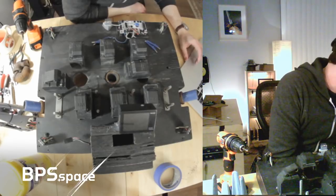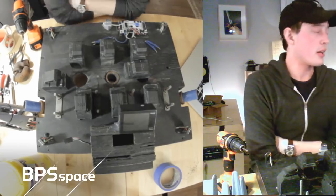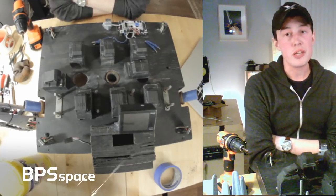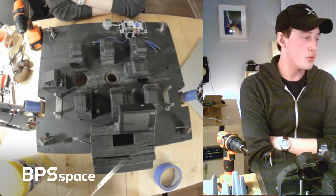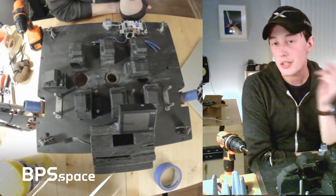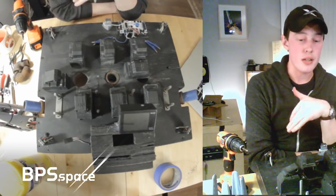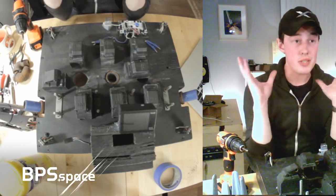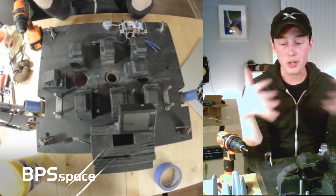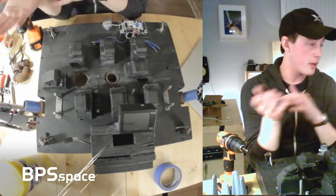Okay, let's do two more. How exact is the height measurement in the rocket? Well, the barometer at any given moment could be up to 2 meters or 1 meter off, depending on the noise, just because it's very sensitive. However, on average, it's good enough to about a quarter meter, a little bit less than that. If you average it out and filter the data enough, it actually gets pretty smooth. So this is another one of those things that can be fixed in software so that your hardware is cheaper. If you're willing to put in time to make your software work a little better, you can usually save a lot of money on your hardware.